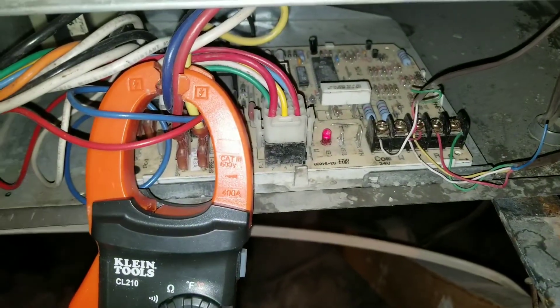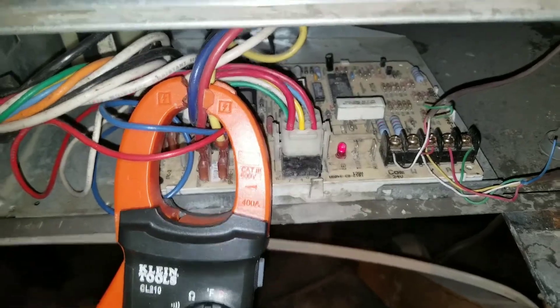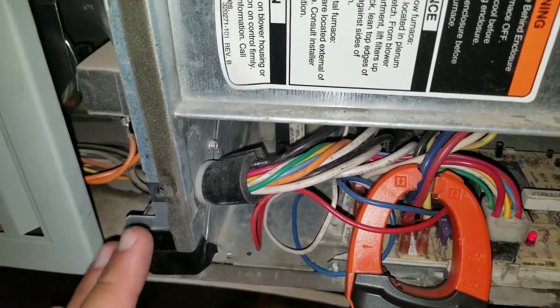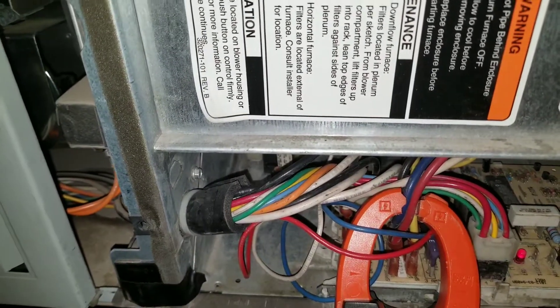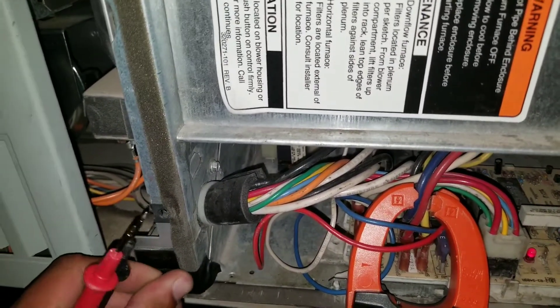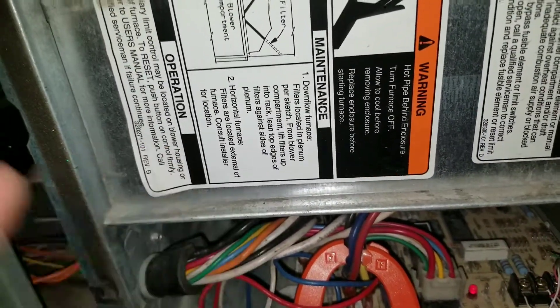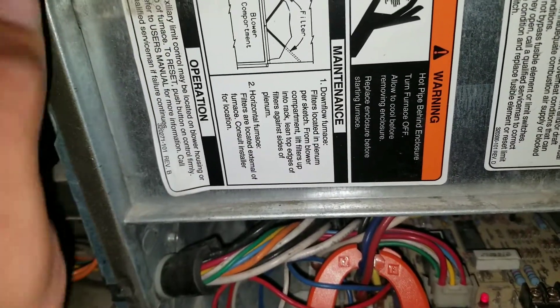You want to make sure when you're working on your furnace that you're careful. What I did is I used the safety switch — this switch has to be engaged in order for you to properly test your system. I put some electrical tape just to engage my safety switch because I removed the panel, so right now the system thinks the panel is on.